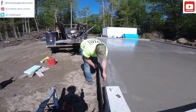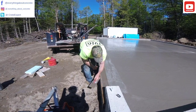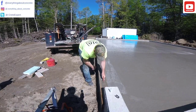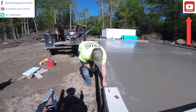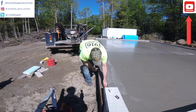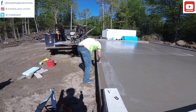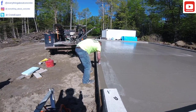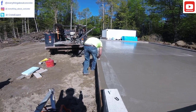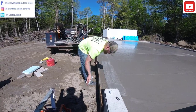As you can see, Darren — the first thing we do is we dig out about a half an inch of concrete. We set our form board right even, right flat with the top of the concrete floor. So when we dig this concrete out, we can just eye it down about a half inch. And then he's running his mag right back and forth to make sure that's nice and flat across there, because you don't want it to look wavy. He'll get that dug down a half inch and get it looking nice and smooth right there.